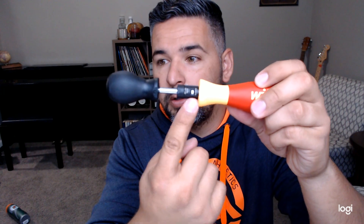So what is the con with the Wiha? It's in inch pounds, has a nicer handle in my opinion with a good grip — but here is the con: you need an extra tool to set your torque. You use this little separate tool to change the torque in inch pounds; right now we have it set to 20 inch-pounds. You do need another tool to use this tool, which kind of bugs me, whereas with the Wera you can just set it right in the handle.